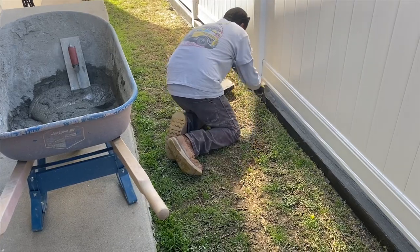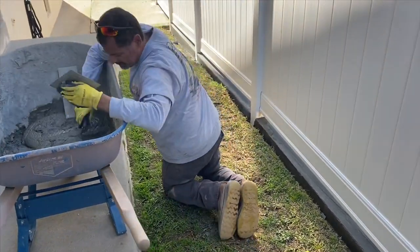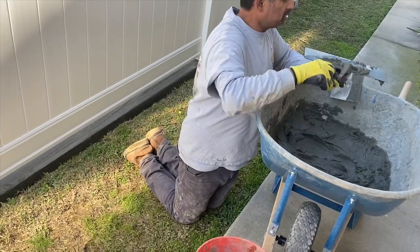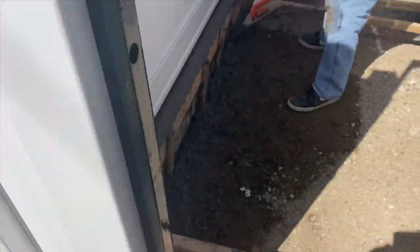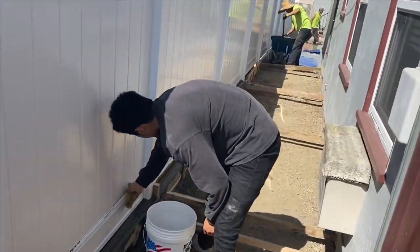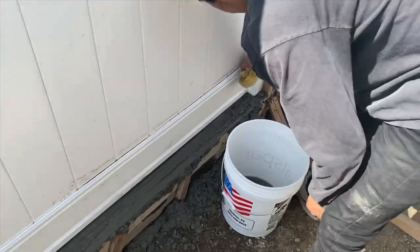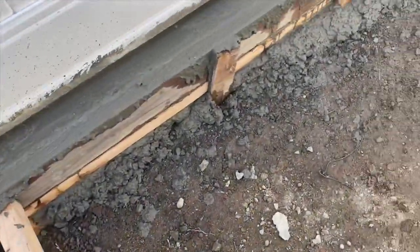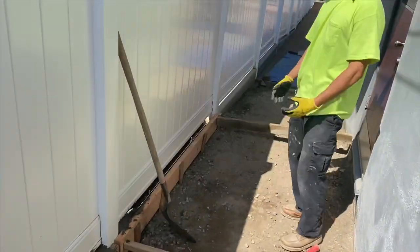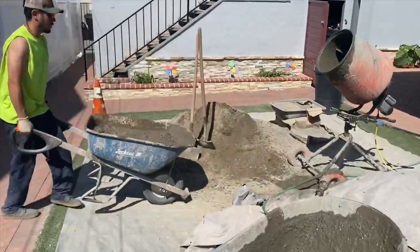Father Vega and Xavier Vega are on the opposing apartment complex, the other side of their grass. We're pouring a divider curb between the vinyl fence and the neighbor side, because the difference in elevation changed after we put this fence up. We also did some pavers here. The paver walkway was changed in elevation — water was falling towards this apartment complex building, which it should not have been, so we fixed it and that's why we needed a divider.